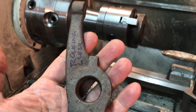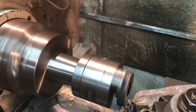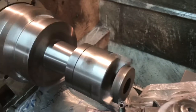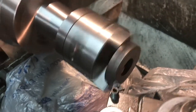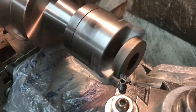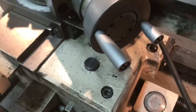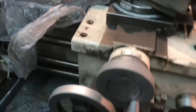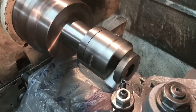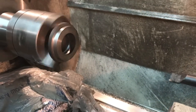Those are the pieces we'll be working on this week. Taking a final pass on this side — I slowed it down to about 200 RPM; 600 was way too fast. I'm taking off about six thou. I have my carriage locked — a nice feature of these lathes, you can lock the carriage with a hex wrench and it's automatically feeding — so it should get a nice finish. After this I'll turn the outside, and it should be the last pass with the boring bar. It's not a very thick piece so I'll take it off and pull it out — it was just a little snug a second ago.